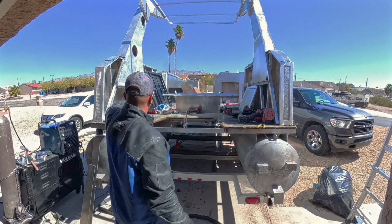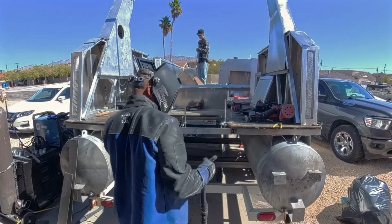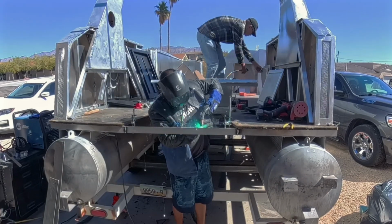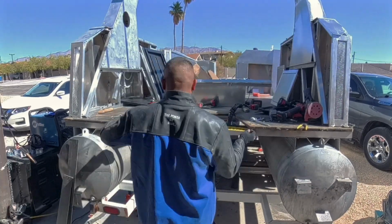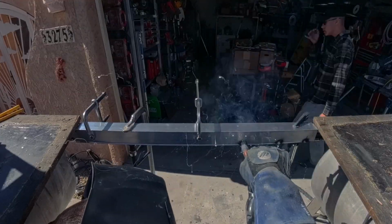To make up for that 3/16 inch gap, I used angle and wrapped it around the bottom, so it filled that void and made it look like one solid piece. But on the inside, I needed to do the same so the top would level out, so I could put a new piece that would level out with the plywood itself.